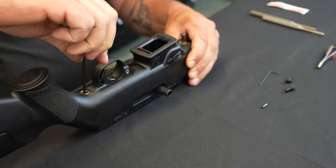Step 6, function check binary mode scenario 1. Ensure the hammer is cocked on the sear. Move the safety selector to binary mode. Pull the trigger and keep it held back. The hammer should fall forward and impact the firing pin. Re-cock the hammer on the disconnector. Slowly release the trigger until the hammer falls to the firing pin. Keep your finger held at the point that the hammer fell forward. Re-cock the hammer on the disconnector. Release the trigger and the hammer should reset to the sear.